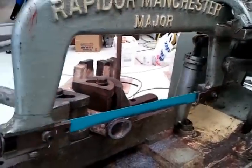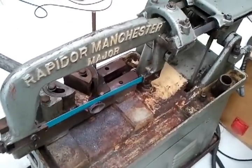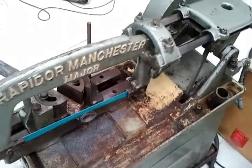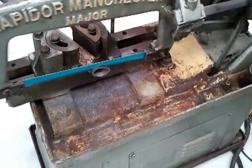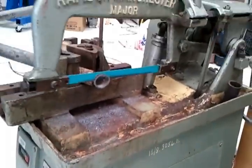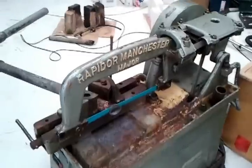At the moment I've got the inverter set so it's running about a third of the frequency of normal mains frequency, so it's going a lot slower than it would. That's because I haven't got any coolant set up for it, and also because it's on wheels on this base here. At some point we'll have to set up a nice level base, maybe even bolt it down, then we can ramp the speed up.